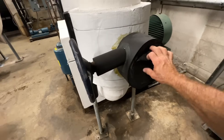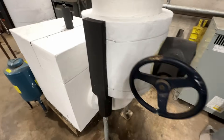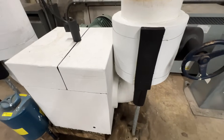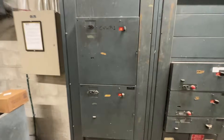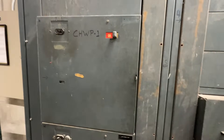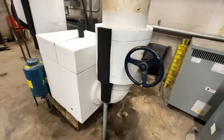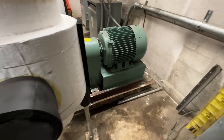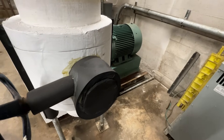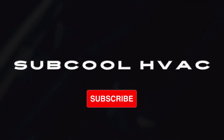I went ahead and opened this back up a little bit more - I didn't want to leave it shut down too much. We agreed with building maintenance to come back next week when it's supposed to be cooler out. We'll open up that starter, check the contacts, definitely clean up the contacts on fuses, and make sure everything's good and tight there. That may help out with our amp draw. The chillers aren't having a problem, but we don't want a failed motor before it's necessary. Thanks for watching - I'll probably make another video on the repairs for the motor. See you next time.